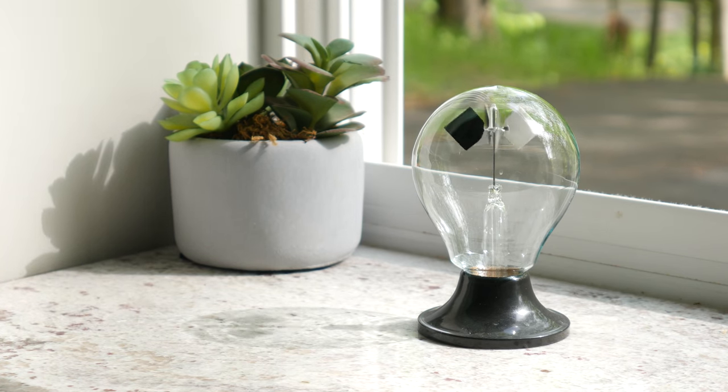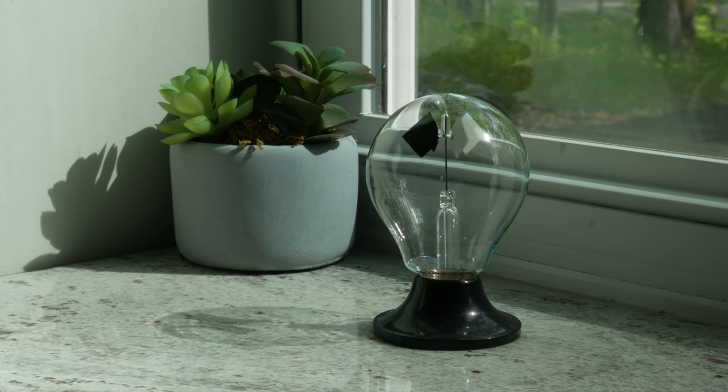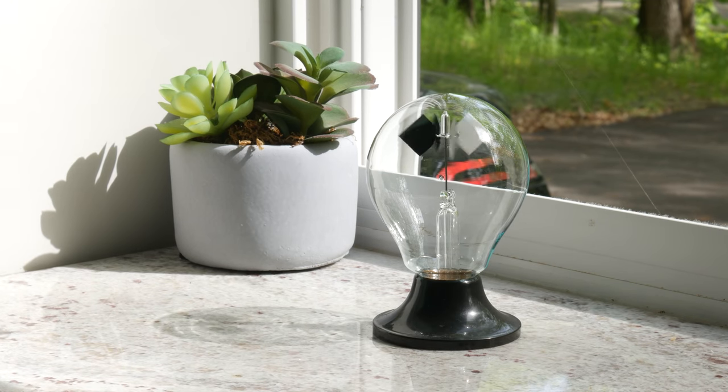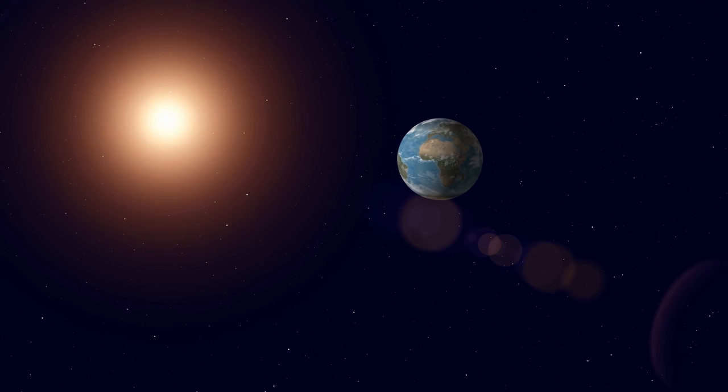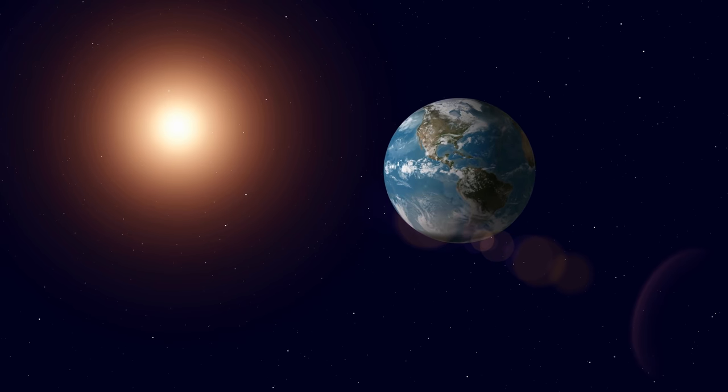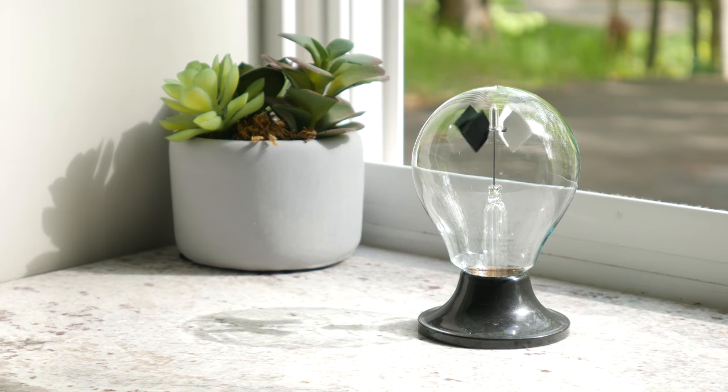How this is accomplished doesn't really matter for the purposes of this video, but let's talk about it anyway. This window, like many out there, features low-emissivity glass, often called low-E. A coating was deposited on the glass which rejects much of the near-infrared light that hits it. Since glass will absorb certain IR wavelengths, we want those wavelengths to be reflected away before they even hit the glass, otherwise the glass would be heated by this energy and end up allowing much of it into the space anyway. While visible light does plenty of heating by itself, a slight majority of the sun's energy that reaches Earth's surface is infrared.